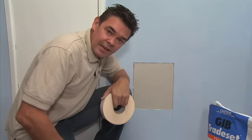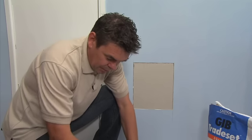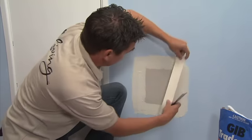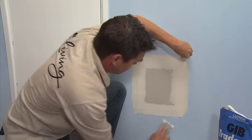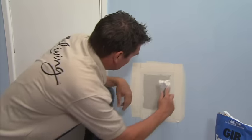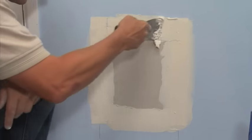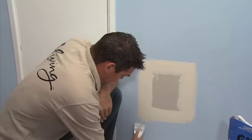The glue is dry and the patch is secure. The next stage is going to be plastering the joints. For that, I'm going to need a roll of Jib paper tape and some Trade Set 20 that I've already mixed up. Using the broad knife, I want to apply some Trade Set 20 to the joints. Make sure the compound is worked properly into the joints, and then put a length of paper tape into the joints using the broad knife, dragging it across the face of the tape to ensure there are no air bubbles underneath. When all the paper tape has been applied, go over it with a thin layer of Trade Set, again using the broad knife, to bed it properly into place. Remove any excess, and then wait for it to dry.